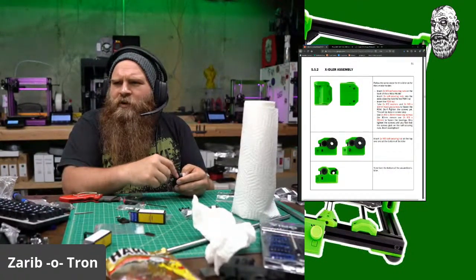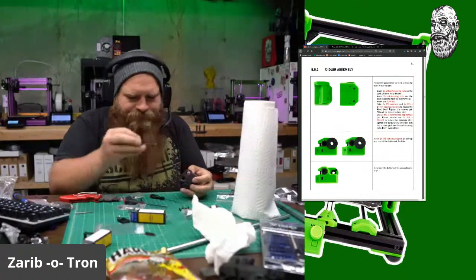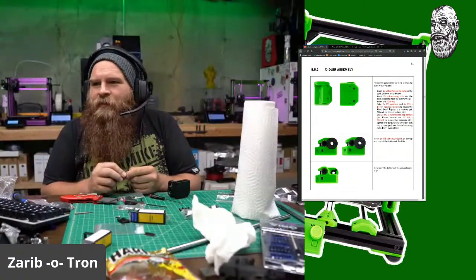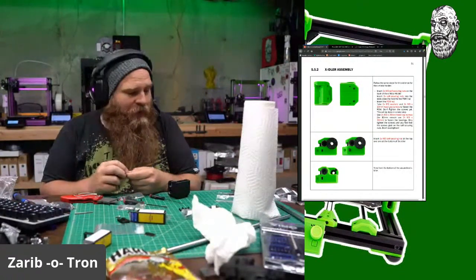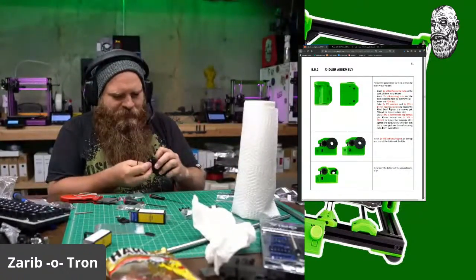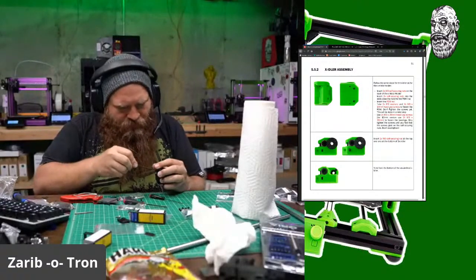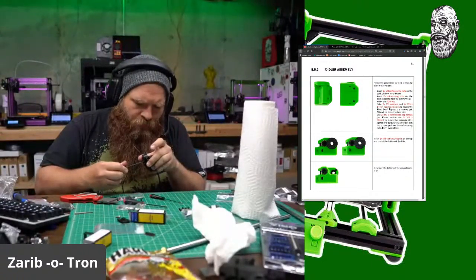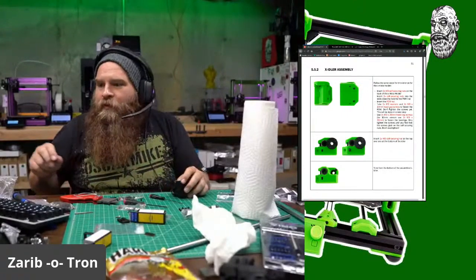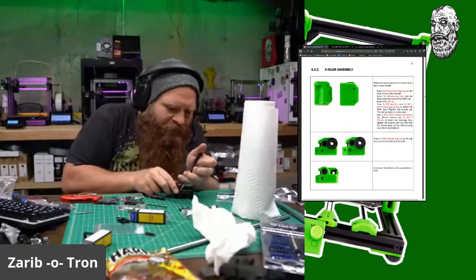How does the heat bed work? No, there is not too much wattage. The heat bed works just fine. It does heat up a little slower, but it gets to the max temp and all that stuff. How stable? Very stable. I print as much as I did on my normal Prusa with an Einsy board without any issues. So I find no stability issues whatsoever. I do not use the 5-volt fans. I upgrade them to 24-volt fans. Some Mechatronics action.